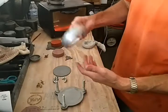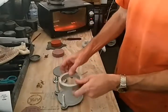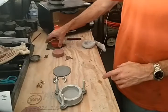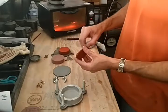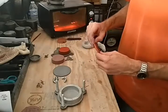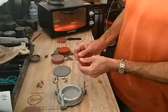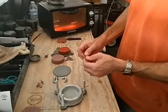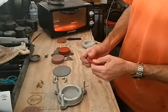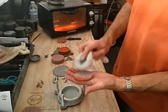This is the mold frame — it's got a hole drilled through it for the brass rod, and that sits right down there like that. Then I've got a generic mold rubber here; it's got paper on it, you've got to peel the paper off. Then you knead it down with the thumb and fingers, and you want to stretch it out so it's about the right size. Add a little powder to the bottom.